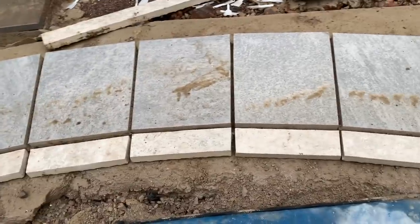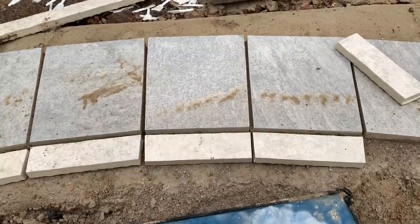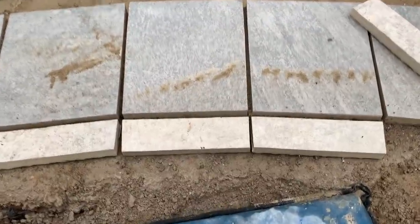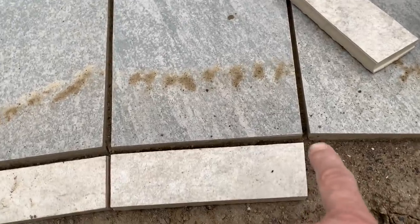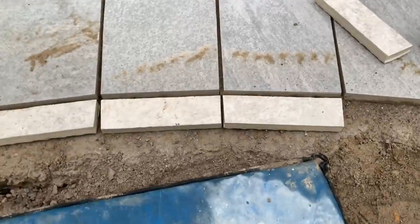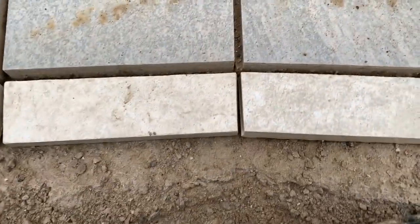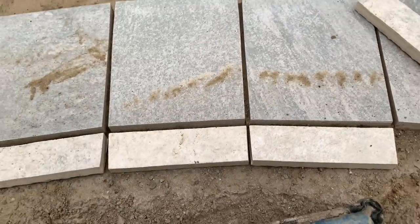So I'm doing the ivory veneers today. Even though I've got a really good saw and everything, it's really hard to get my jig set up perfectly, and if there is a little bit of tolerance, like that might be a millimeter bigger than that one, it really affects it. So I'm ending up with crappy little joints like that. What I'm having to do is use my grinder and shave the edge down a bit. I'll set my camera up just so you can see it.